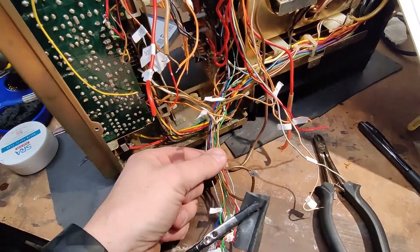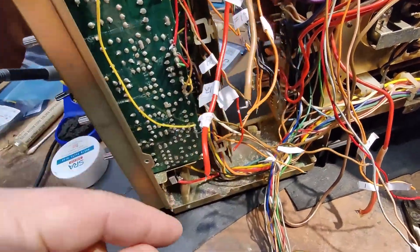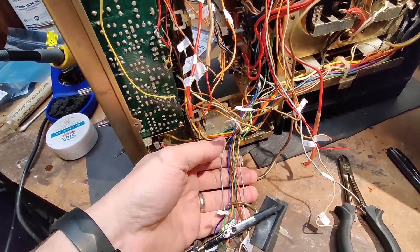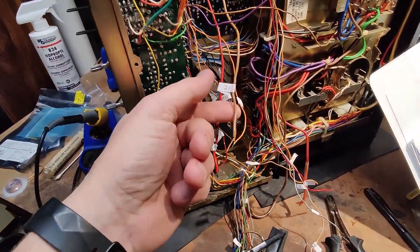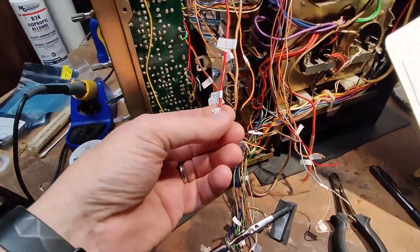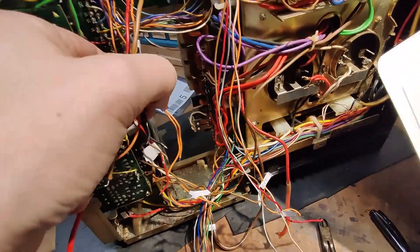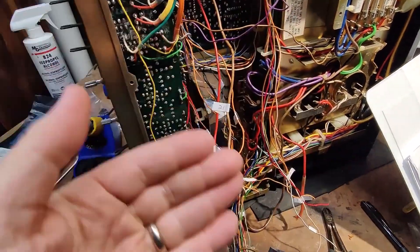When they re-soldered and reconnected the various wires, they did so in such a fashion that it was behind wires and crammed in there, so you could not bring this card out to service it. These are all things to think about — not only making it look good and functional, but also making it easier for whoever has to go back in there. Label everything and take lots of pictures, because if something falls off you can use the schematics, but schematics are a reference and not always 100% accurate, so having before and after pictures is good too.